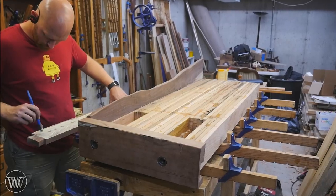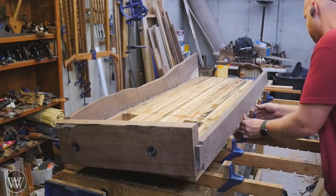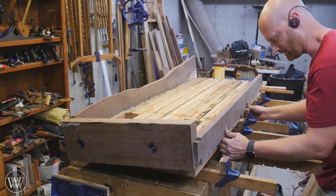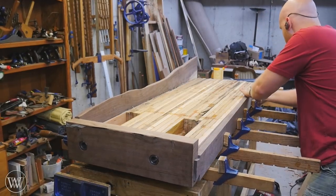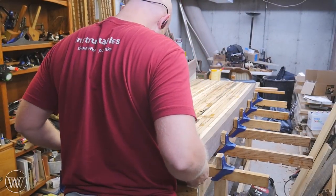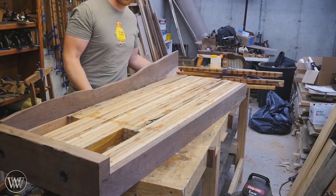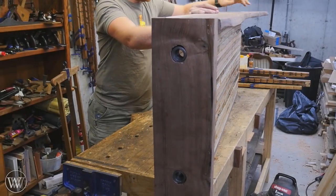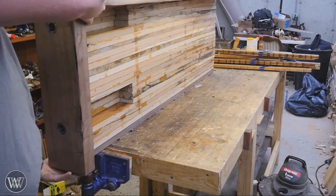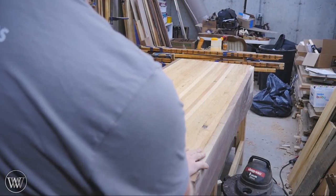For the final glue-up, I start by putting one tail into the end panel and then glue up the other one and slide it in. The end panel is not glued on — it is floating — and that is so that there's expansion and contraction across the top. It will allow it to slide on those dovetails a little bit. I will be putting in a pin in the middle in the future, but for right now this is all that there will be. After letting it sit overnight, I can pull the clamps out and flip it over and get my first view at what this top will look like. And I'm loving the white oak and walnut — the contrast between the two is fantastic. I'm really looking forward to seeing this thing on legs.